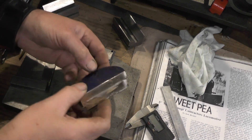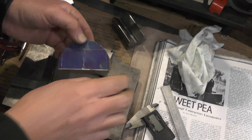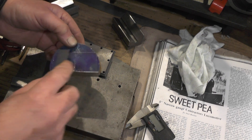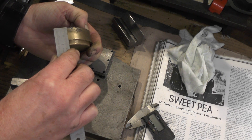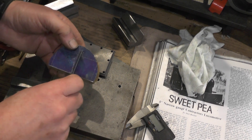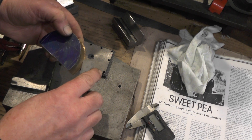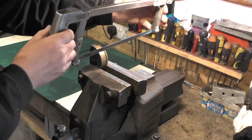I've got this little piece of bronze, I've taken the rough bit off the edge, I've marked it all out for the footprint and you'll see here I'm a fraction short on that corner — not much. So what I'm going to do, I'm going to get this cutter out. I've got enough on the thickness — 11 sixteenths, I've got a sixteenth to play with on the thickness. So I'm going to do a bit of work, get this cutter out, and on these two corners I'm going to silver solder an extra piece of bronze just to fill that corner in.